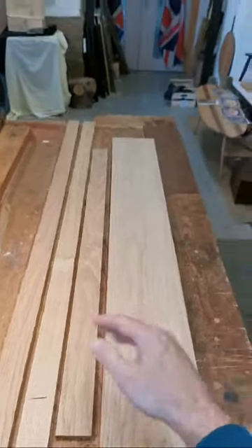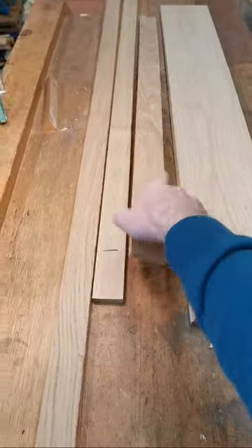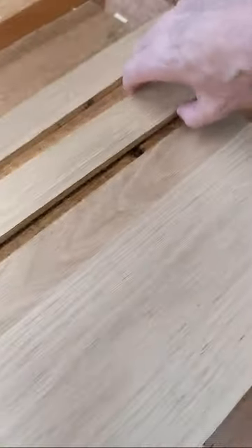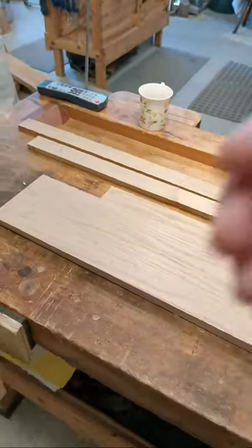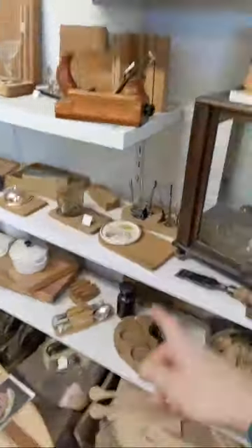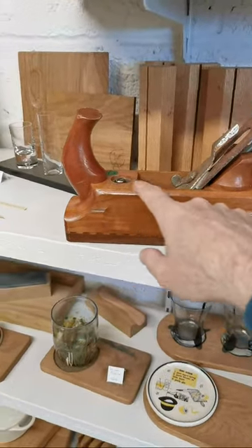Timbers are over here for that - these are the uprights on the two sides and the back corners. I'm just going to start marking out, but I can't mark out to length because my timber is a little bit warped, a little bit twisted. So these are going to be worked out to shoulders. All dovetails on the ends of all these, so I'm going to have some fun with those because the dovetails will be more or less touching the floor. Shoulders on there to sort out, then dovetails on the end, and once those are done that'll be great. I did a little bit on this yesterday while I was waiting.